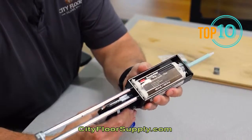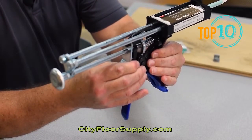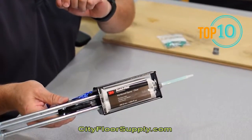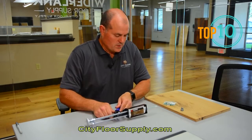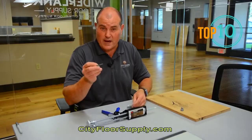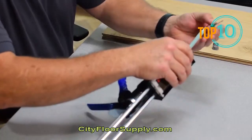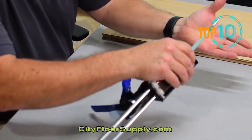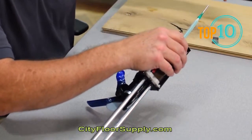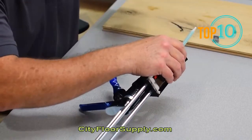So we're now using our old dispensing unit with the new style epoxy and the new style mixing nozzle. Just to note, the replacement needle tips for the hardwood floor epoxy kit are eventually also going to come in this new style — they still fit the new mixing nozzles. They just push right on, so they work perfectly. Your little eighth-inch drill bit tip to drill into the floor and do a repair will work just like you normally would.